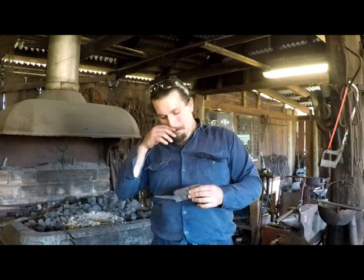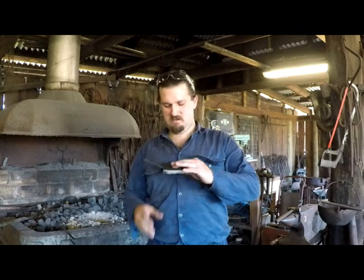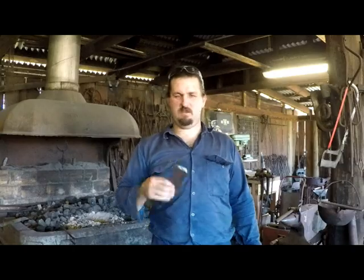You can get a pattern by folding the same piece of steel in on itself, but if you've got 2 different grades of steel that etch at different rates, it can give more contrast. But because they're so thin, it might just basically draw out to nothing in the end product, so I might not bother with them in the future. Not the most glorious of endings. I got myself a paperweight. Glorious Nippon paperweight. Okay, it's not.